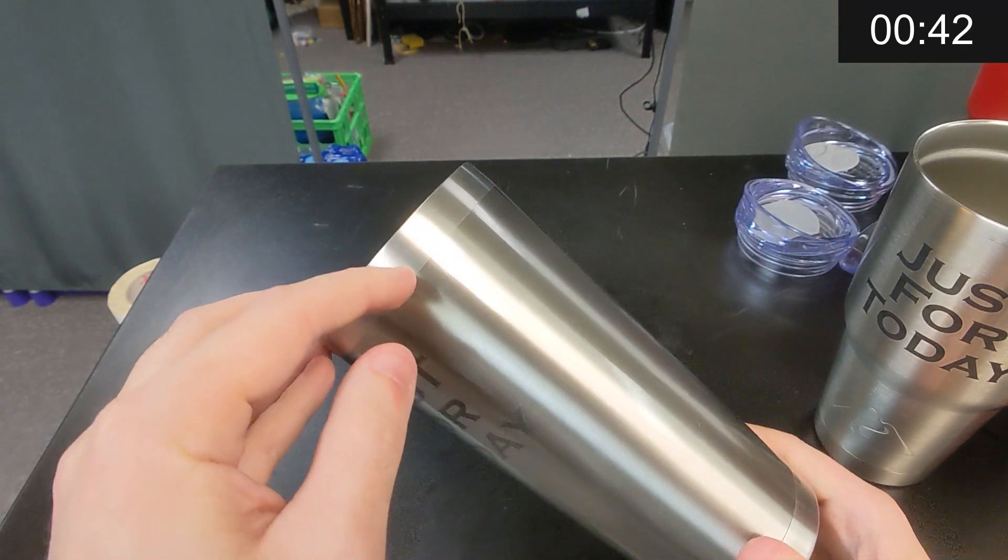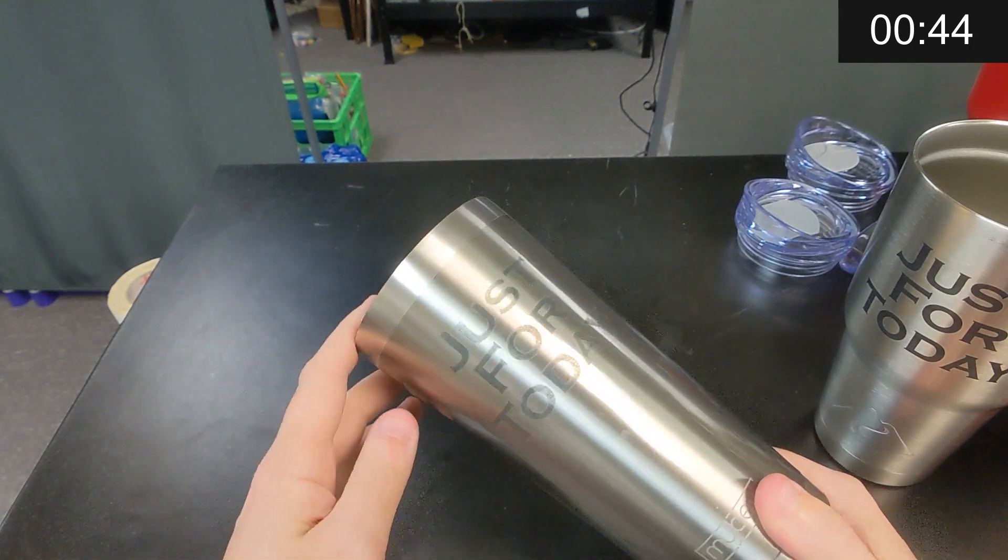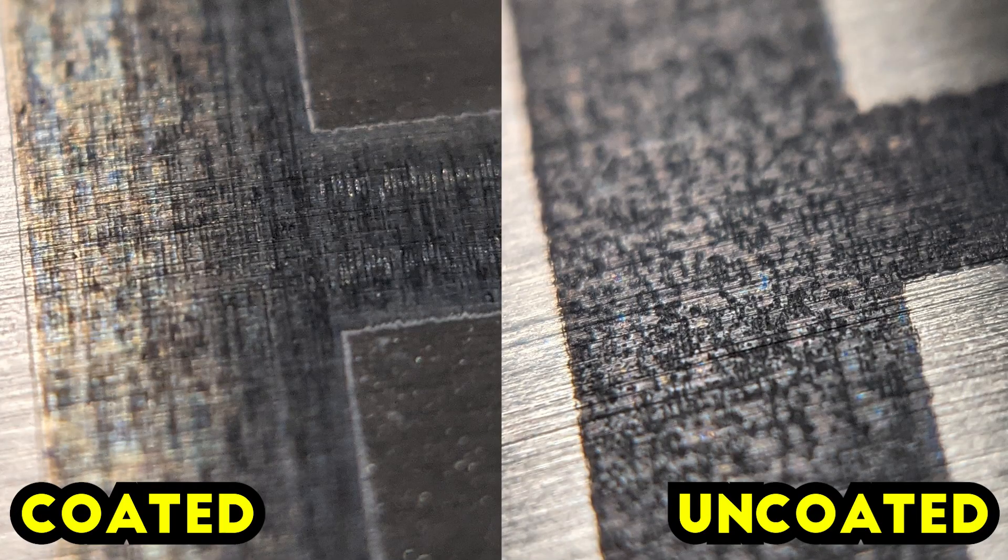We really don't want to try to engrave this. If you engrave this with a fiber laser, it's going to bubble up and melt. If you engrave it with the CO2 and you try to use something like Brilliance Laser Inks, it's just not going to stick.